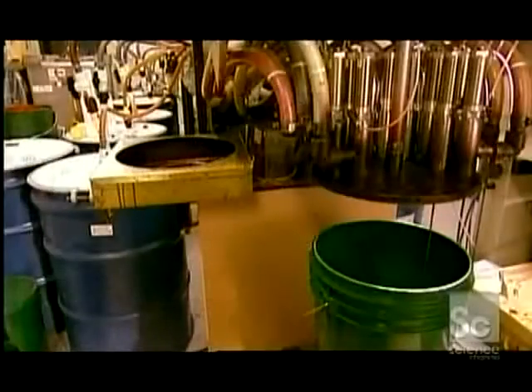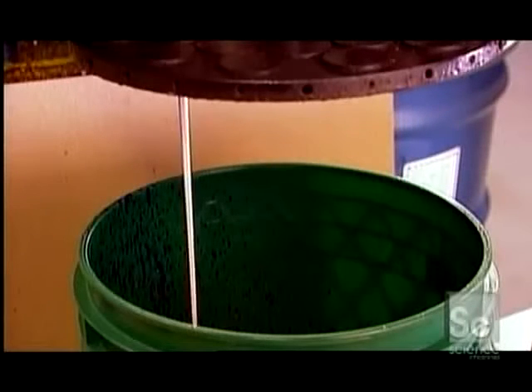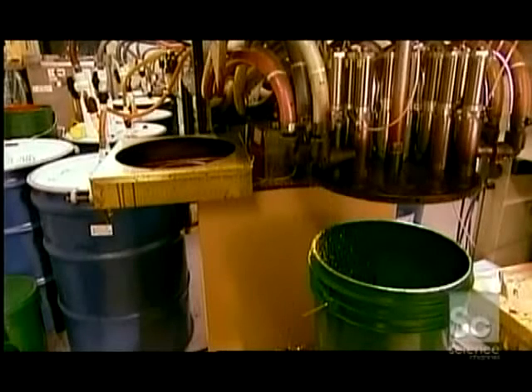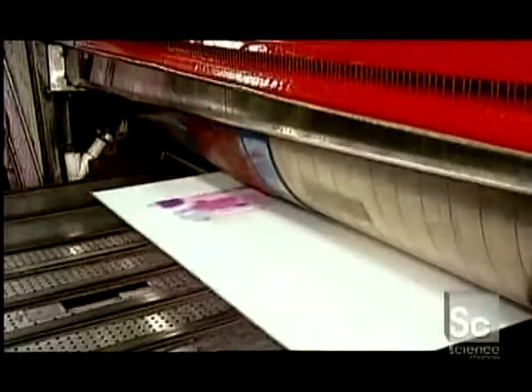The printing of the boxes begins in the factory's ink kitchen. A computer-guided dispenser squirts out different shades of ink following a precise recipe to create a particular color — one of 5,000 in the palette. One pail holds about 45 pounds of printing ink, enough for 2,000 boxes depending on coverage needed. The factory uses water-based ink because it dries instantly. The printing press applies the ink one color group at a time through four consecutive stations. This factory uses a flexographic printing system, which can print drawings and illustrations, while some companies use a lithographic press, which can also print photographs.